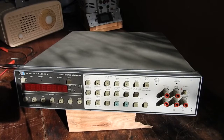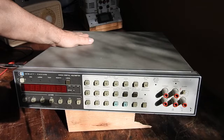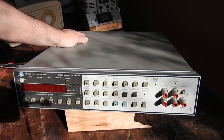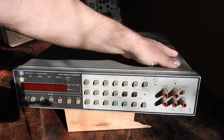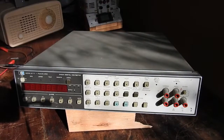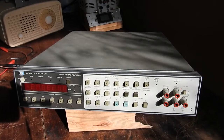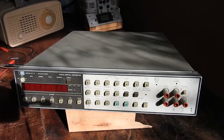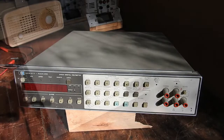Better open up and see what we can find. It's a bit of a worry because I believe the power supply is over here, which would be the easiest thing to fix if there were explosions and smoke. If it's in the analogue in-guard section that would be fiddlier and more fragile to fix, and even if it can be fixed, it certainly means recalibration is required. So let's just take the lid off and have a quick look inside.